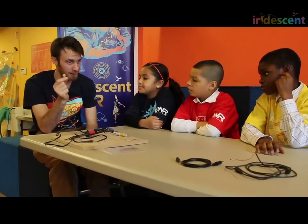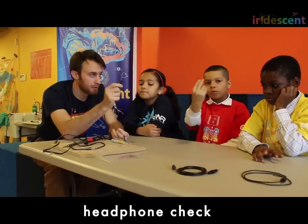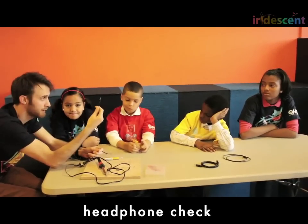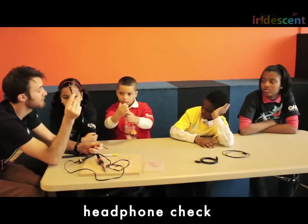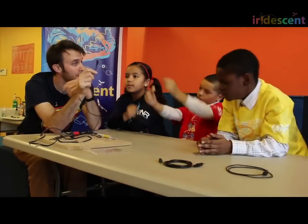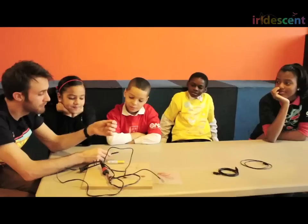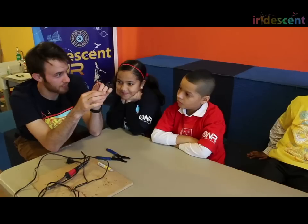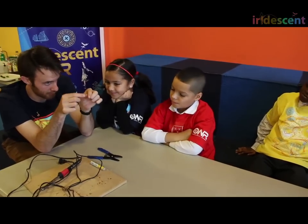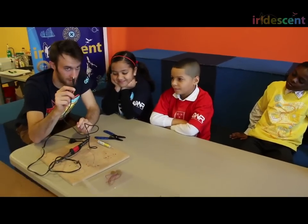The basic thing we're going to do to make our contact microphone is we're going to take one of these piezoelectric discs and actually connect it to something that looks like what you plug your headphones into — like an iPod — this is the thing you're plugging in. So we're going to make our microphone into one of these so that we can plug it into a computer or into an amplifier, by making an electrical attachment between our piezoelectric microphone leads — the wires coming out of it — and the headphone jack.